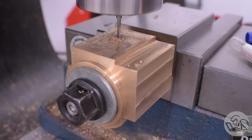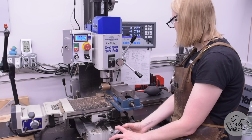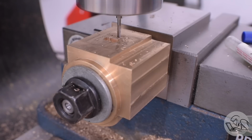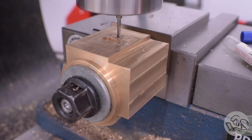With normal engineering prints in a situation like this, you can take a measurement off of the drawing directly. It's not ideal. You certainly try to avoid doing that, and you try to deduce the measurement from other dimensions, but if you can't, then that is a last resort. However, you can't really do that on Kozo's drawings. They are drawn to scale. He is careful about that. They're always 1/2 scale, pretty much.